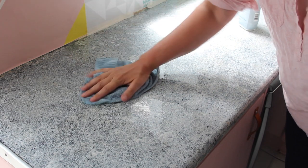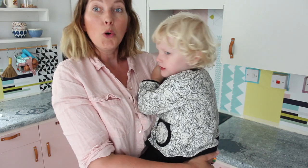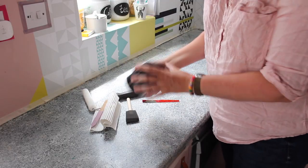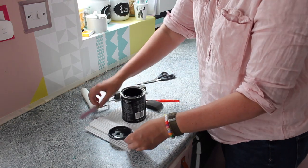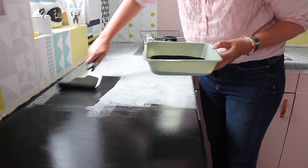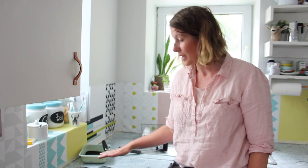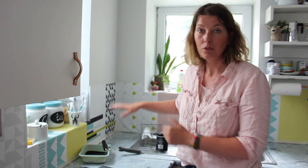I've put a little bit of tape here just to make sure the wallpaper sticks to the wall. I've taped off the edge of the cupboards and also the edge of the wallpaper so no paint gets on there. It's all prepped and now it's finally time to start painting — she's not too happy; she's not allowed to help. Let's give the primer a good shake. Hope this paint is still good — it's been in the shed for five years. The advice is to work in small sections: you do the edging first over about 80 centimetres, then you roll, then you move to the next section. It's pretty dark; I don't know if I like it, but let's continue.